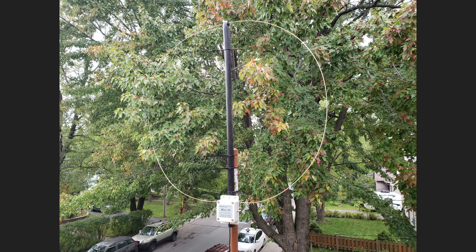Remember, a lot of people are under the impression that grounding also protects you from lightning. Well, it doesn't — it has nothing to do with that. Grounding is more about, in the case of antennas where you need a ground, it's usually much more about lowering the noise level, because a good ground can sometimes lower your noise level.